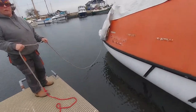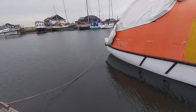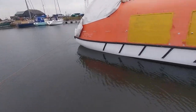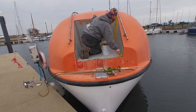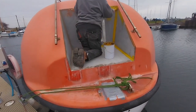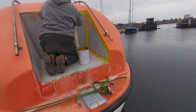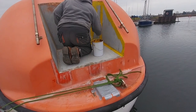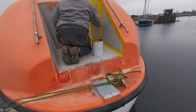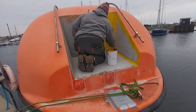With the skin fittings in, there is one more job to be done, so letting go of her stern to make it possible to get on the side. The other job we need to do as we are moving her round is to put some paint on the new cutout on the bow, as I filled the seams with thickened epoxy and that will disintegrate over time if we leave it exposed to UV light. I know it is still winter, but it is better to be safe than sorry. I am using floor paint for this, as it is just there temporarily and it is cheap and easy to use.